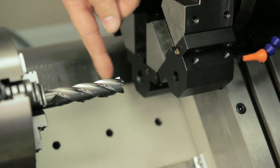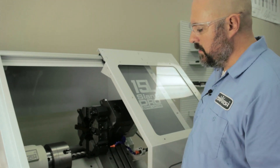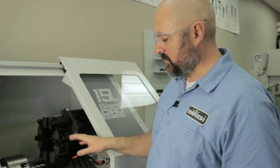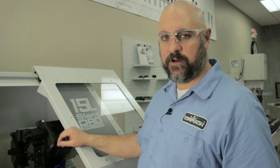This is an extended-length carbide end mill — it's going to be rigid and hold size real well. But the thing with extended-length carbide end mills is they like to chatter, so I'm not going real fast. That's because you want a good finish and you don't want it to shatter on you.